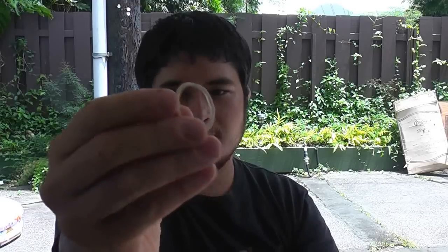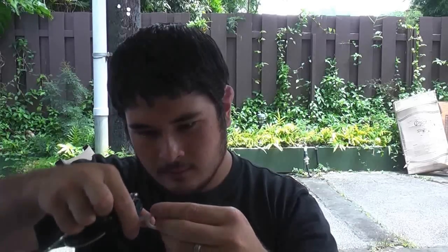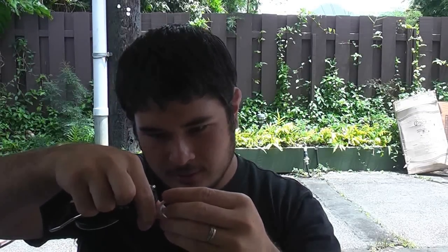As you can see here, if I'm pressing on the Schedule 40, I can barely get it to deform with my fingers. If I take the thinner PVC pipe, I can actually crush it between my thumb and forefinger. You guys just need to be careful when you're out selecting pipe. One good way to check is to just look at the wall thickness — the Schedule 40 wall thickness should be about 1/8 of an inch, whereas the thinner wall PVC will be about 1/16 of an inch.